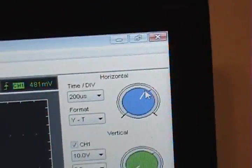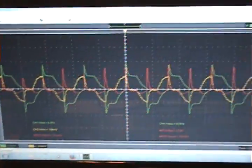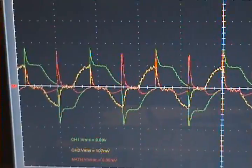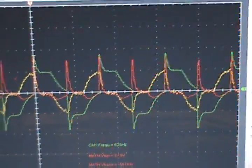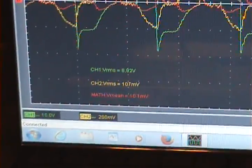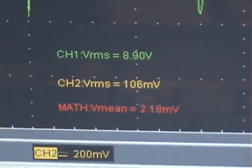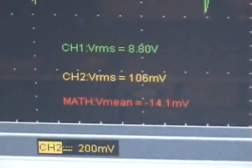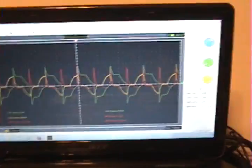I will reduce the time division to get more samples. Now we are seeing a better picture with many samples, and we can see all our peaks — those are the returns. You can see variations in the returns; some are peaking and dropping back down. Right now we are in a mostly positive means, but it fluctuates. We don't have enough samples yet to get an accurate reading.